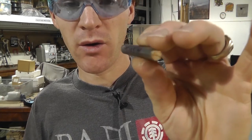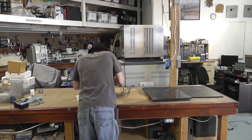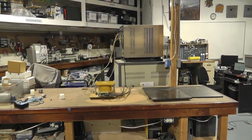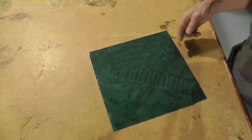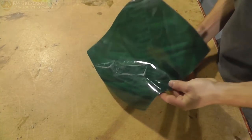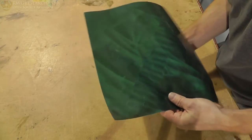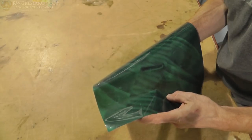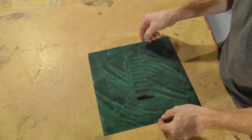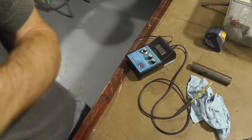I got this magnet up to 800 plus degrees Fahrenheit, glowing red hot. It's pretty hot. I've got it marked. Now let's look at the heated magnet — let's look at the side. It's still the same result. Not too bad, fairly straight line, but still a little skewed on this side. Let's check it with the meter because strength has been my problem so far — I haven't been able to get the same strength levels out of this thing.